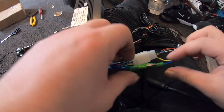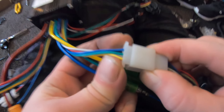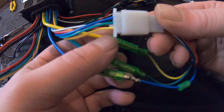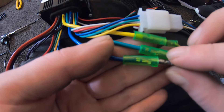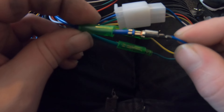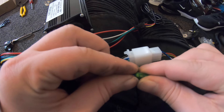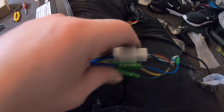Here is the main motor connector wire that goes from the controller over to my rear wheel. You can also get these as front-wheel drive. For connecting up the wheel, you'll always have one large block connector — it's the biggest block on the controller. You can't really get it wrong; just clip them together. Then you'll have a blue wire, a green wire, and a yellow wire with bullet connectors. Push the blue to blue, then slide the plastic sleeve over to keep water out. Do the same with green to green and yellow to yellow.